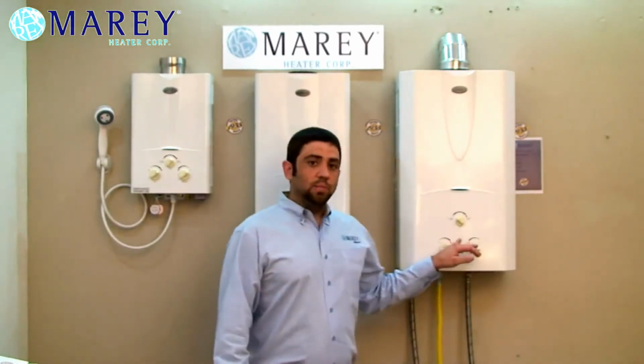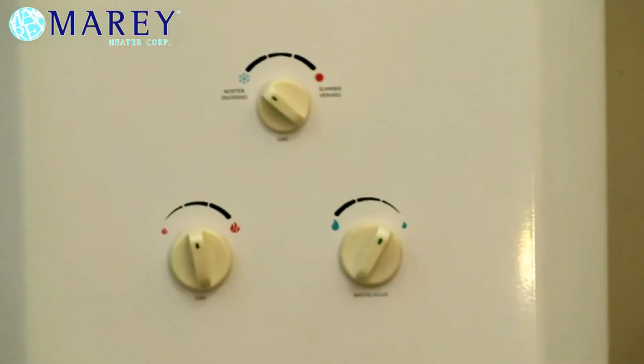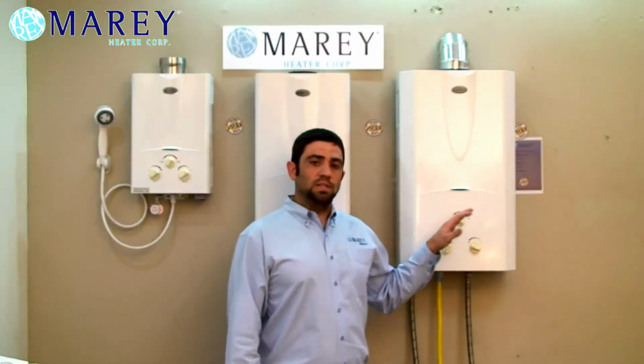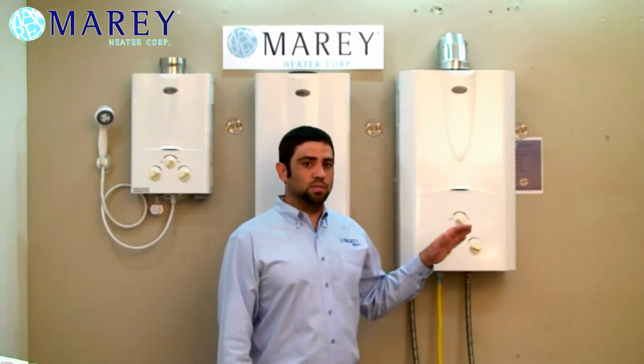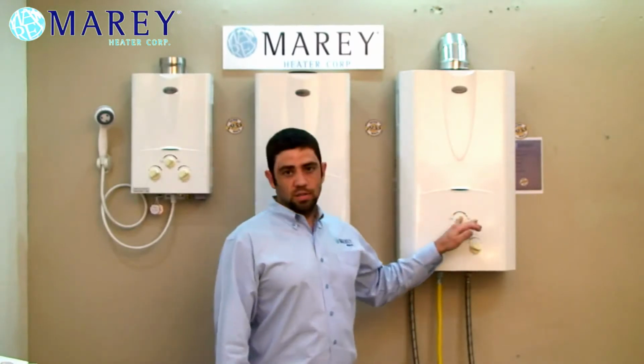As you can see, there's 3 knobs on this unit, and these are the adjustments for the burner. This allows you to adjust and dial in the exact water temperature that you want without wasting any additional energy. With a standard tank water heater, you're heating water all day long, and that's where it becomes wasteful. And also, you can adjust the burner setting on this.